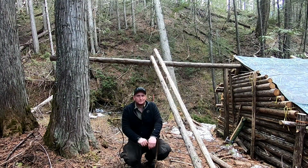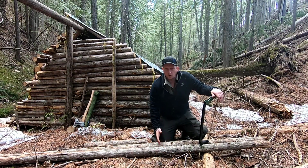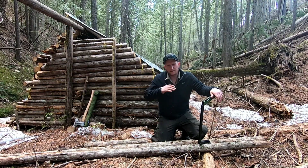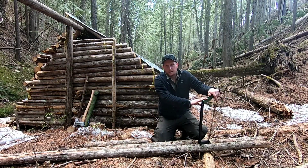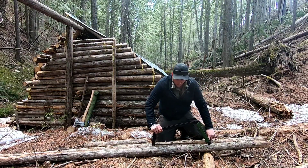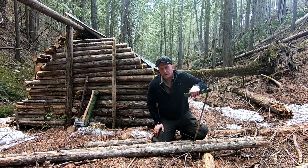Anyways, let's get started. So for these bushcraft chairs, you want some fairly sturdy logs. These are about forearm thickness. It'll hold my weight nicely. And you want to cut four about chin height. It varies, depends how big and long and tall you want your chair, but I've done these before, and for me, about chin height works. That's about 2.5 saw lengths for me. So mark those out, let's get them cut.